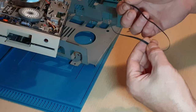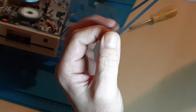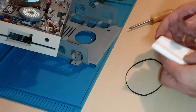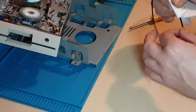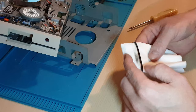You can see it's got little perforations on one side — little grip sides — there isn't much on the other side. All I'm going to do is give it a little bit of IPA, clean it, and pop that one back in. The drive is probably about 30 to 35 years old, so this belt has been sat there and will have accumulated dust, muck, and grease over the years, as you can see.